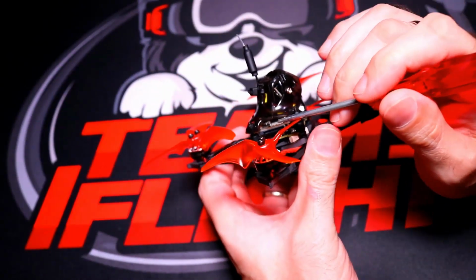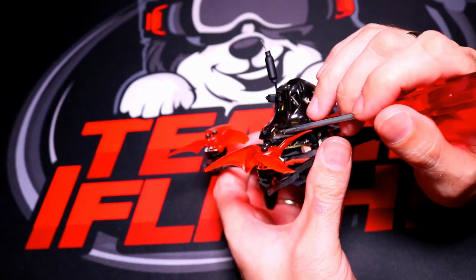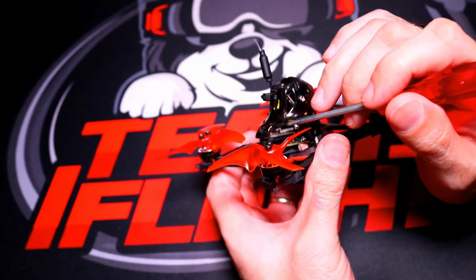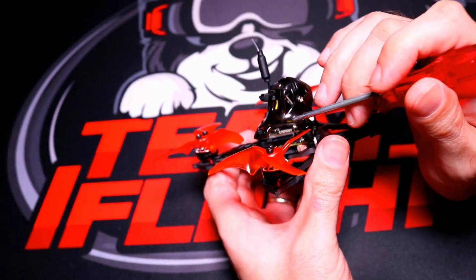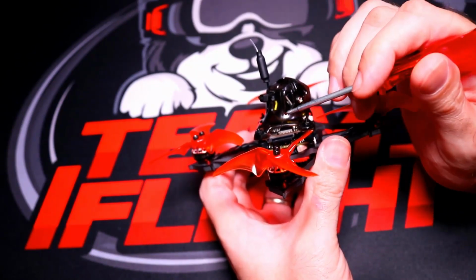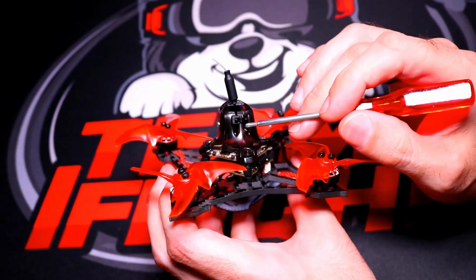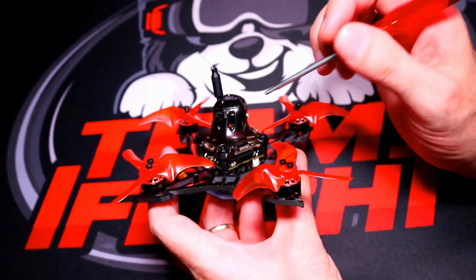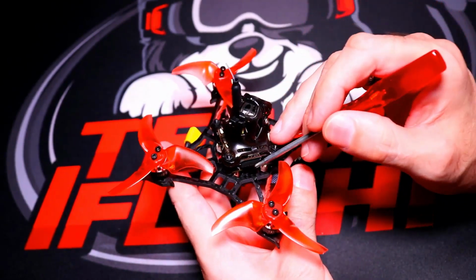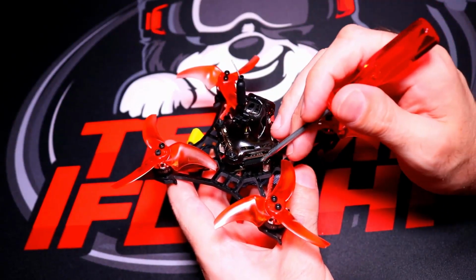Another thing as well, out of the box, my UFL connector for the main VTX antenna wasn't even put on properly. If I would have plugged this in and flown the quadcopter, it would have fallen off and the board could have possibly fried. So make sure you push that in properly, and I've zip tied the main antenna there, so I don't think that will be going anywhere. Also, you want to update the firmware to the latest firmware on the VTX. I'll put the link in the description below.